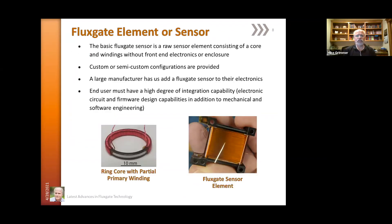There's a little bit more detail about how these flux gates are made. There's typically a ribbon of this highly permeable material that is wrapped around a non-magnetic core. That assembly is then wound with primary turns, much like a transformer — that's the excitation winding. Then the outside is wound once again, once it's installed in a frame, to get the pickup winding, which supplies the sense element where your signal comes from. At this level you have the raw sensor and a significant amount of integration is needed by the customer to outfit the circuitry, digital input or output, and all of the mechanical packaging.